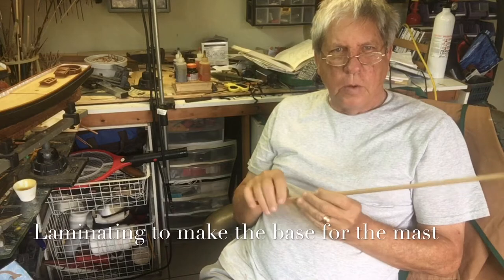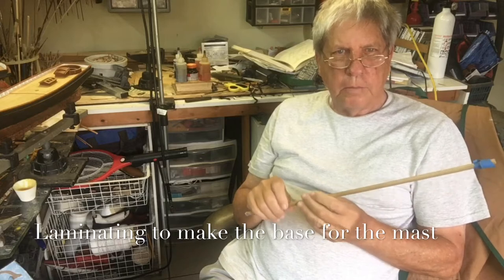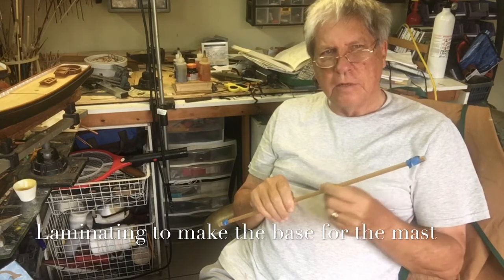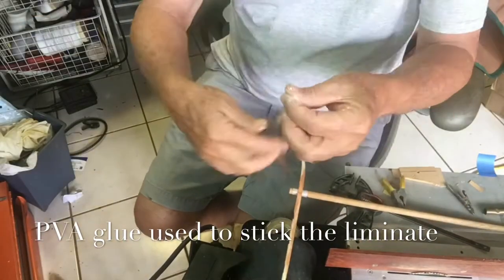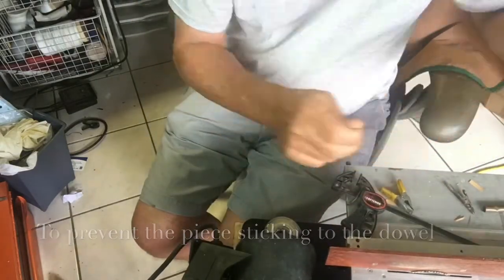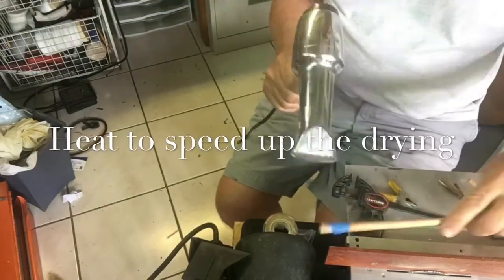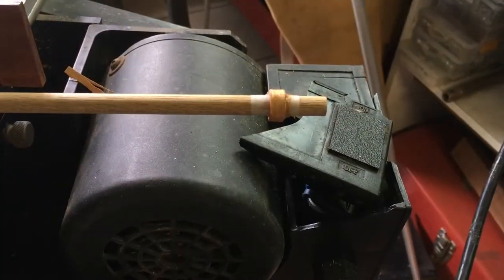This is a short description on how I make my base mast ring. It's also useful for the hoops — the wooden hoops that go over the mast that attach to the mainsail, so that when you pull the mainsail up it stays tight and close to the mast. The thinner the laminate, the easier this is going to be. We are using Caribbean mahogany here. The glue is PVA, simply because if you try to use CA it would just make a mess and stick to your fingers — so you only have one choice in terms of glue.